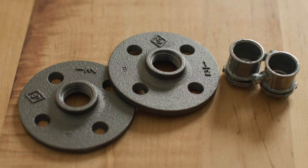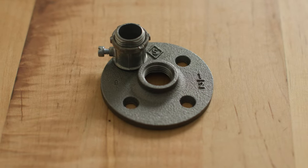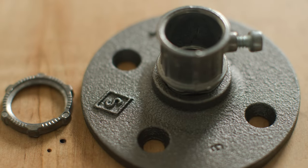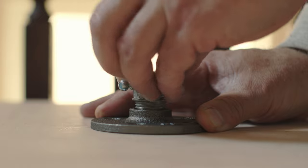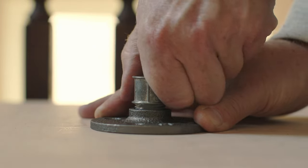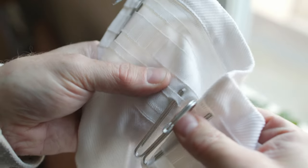The next step is attaching your U-shaped curtain rod to the wall. I grabbed some half-inch conduit connectors from the electrical section of the big box store, then walked over to the plumbing section and found half-inch plumbing flanges, which happen to have threads that roughly match the EMT conduit threads. They're not meant to go together, but if you force them, they do — and they're super solid. It's also super cheap. I screw the conduit connector into the flange, put one flange up on the wall about three inches above the window frame, screw in the second flange, and tighten the locking screws turned to the inside so you can't see them. Don't forget to put your rings on before you fully tighten everything — that's a bit of a drag. Then you hang your curtains, and that's really all there is to it.